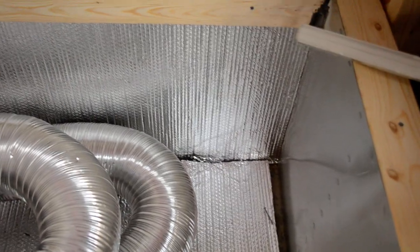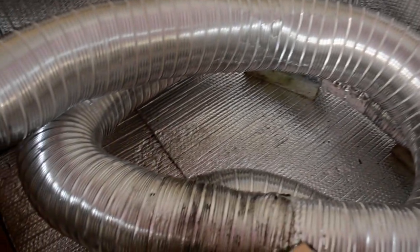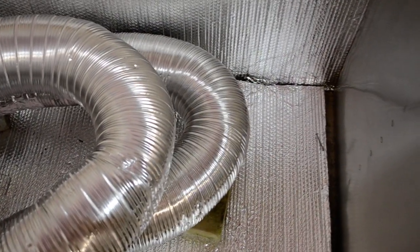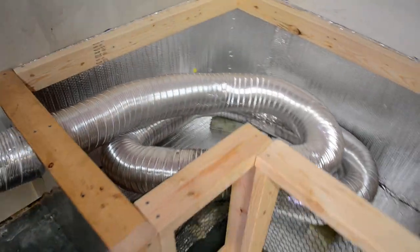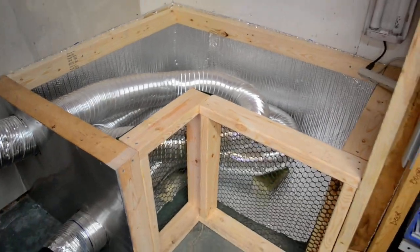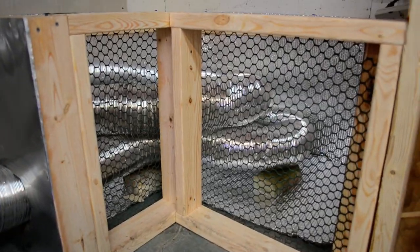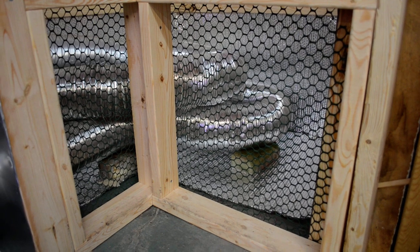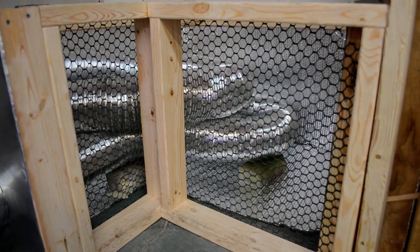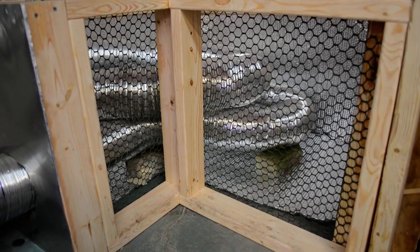I lined the thing with foil-covered insulation so it doesn't pump heat into my outside walls, and I also put foil down on the slab floor because I really don't want to pump heat into my slab or have the cold come up. Then I lined it with sheet metal. I've got a large piece of one-inch thick epoxy top that's going to go on top, and this is a coarse metal netting that'll hold my gravel in but allow air to get up through the stone. I may drill some holes in the epoxy top for natural air convection.